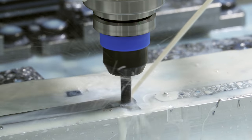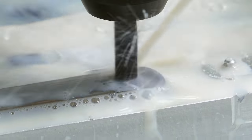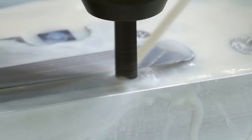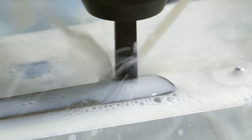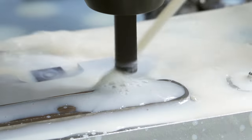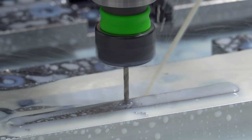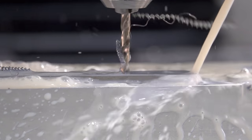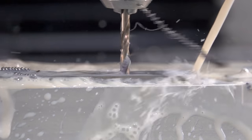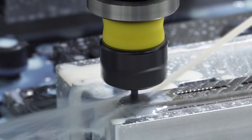The passes are at 45 degrees — sometimes I do this just because it looks cool, but in this case I thought maybe it was to reduce how much heat builds up. Seems like it'll be fine either way. I then switched to drilling. I definitely ran the drills too slow initially and they got all tangled up, so I manually sped it up a little.